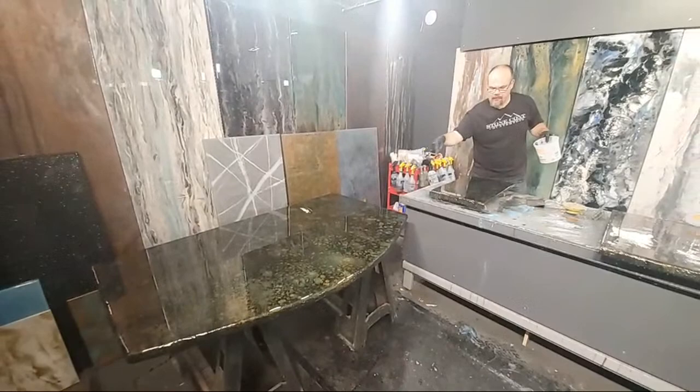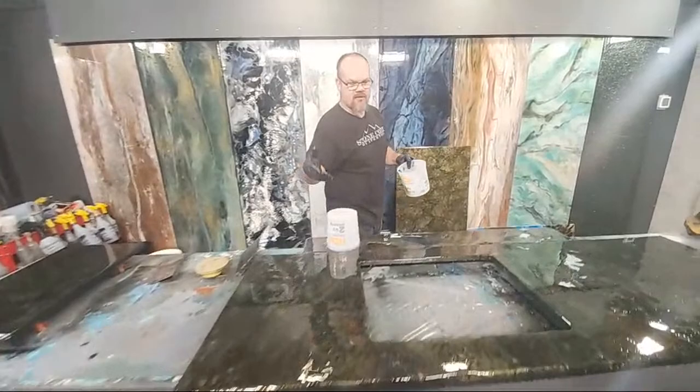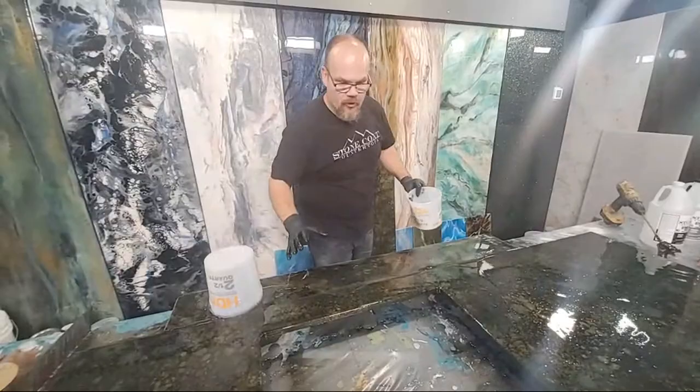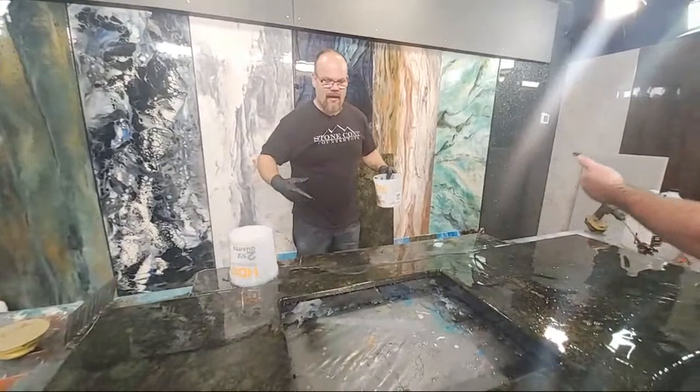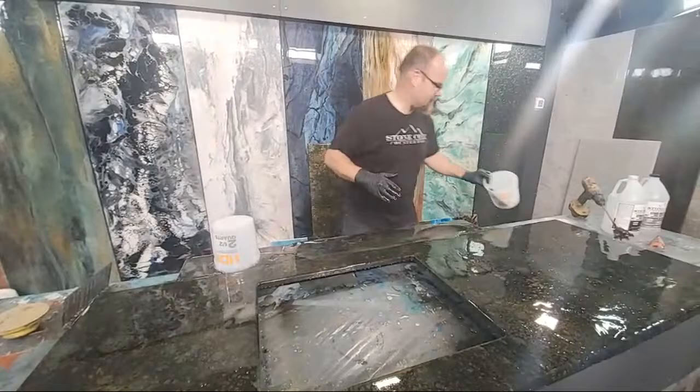The island was our biggest piece, and I had enough extra in my bucket to do the little one. When you pour your project, you can actually butt your windowsill right where it's going to marry up to the sink run and you'll get your effects — if you were to put veins in this, your veins could carry right through. That's a really fun way to create, and you don't waste any material because you've butted them, and then you pull them apart after your effects are done.